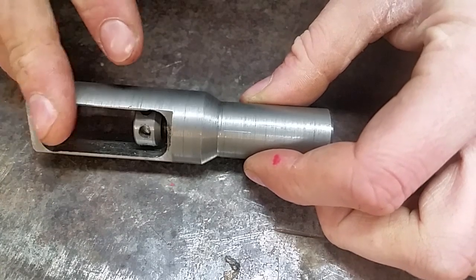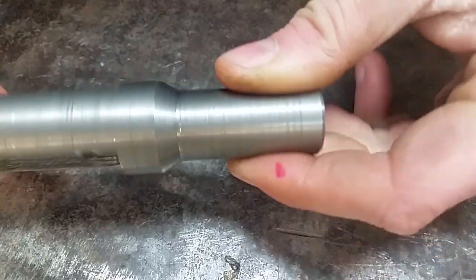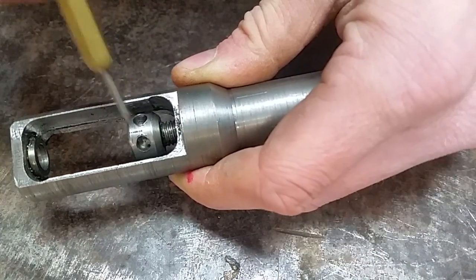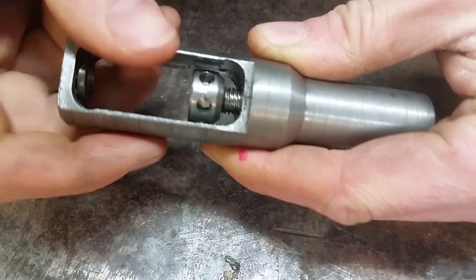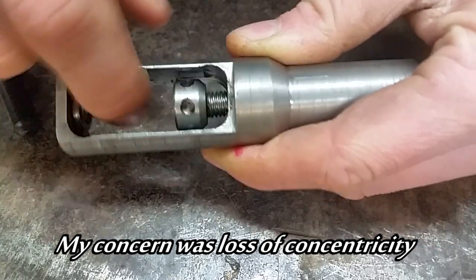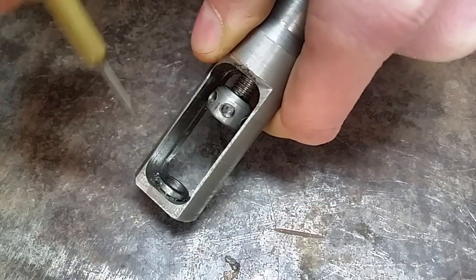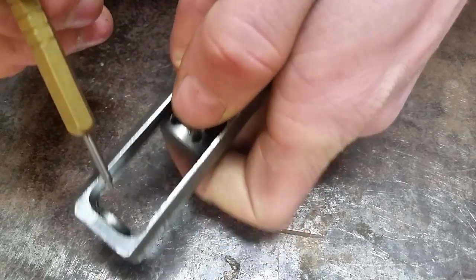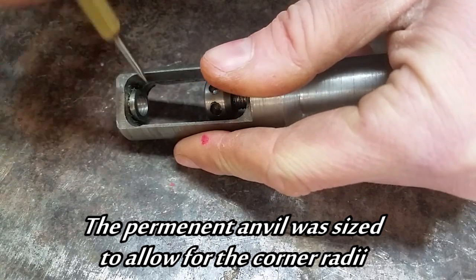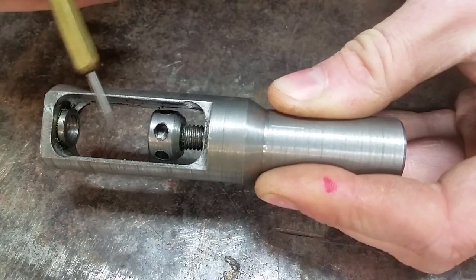A few quick details about this - this shaft here is 20mm, that's the largest collet that I've got. Now this probably could be held in a three jaw, but for doing small precision work a collet's a better option. I did consider an option of having a collet that's screwed on the outside, and that might be a bit more easier to operate than this. I wanted this body to be rigid so I'm pressing the screw head up into a rigid frame. So with the aperture at the end here, this is locked and tied in place. The purpose of this is when I've got the other apertures going on - I was a bit concerned that it was going to hold up on the radius here, so this just acts as a bit of an anvil to push the screw head up against. This is a lot bigger than what you'd normally make one of these - I've set this up so I can do 8mm bolts if I need to.